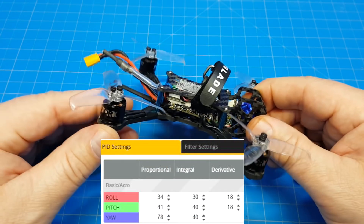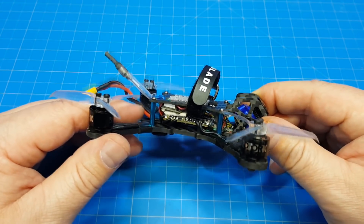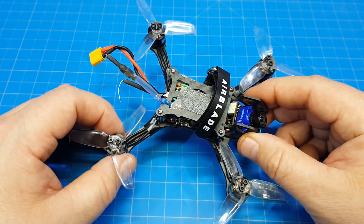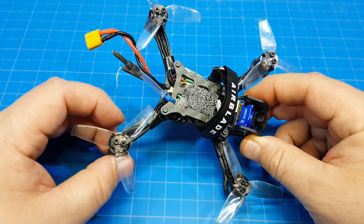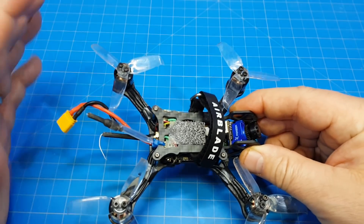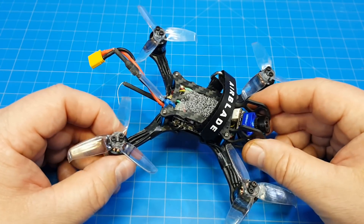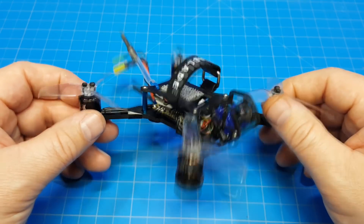Keep in mind, if you're not using these motors in this build or these parts, your results on those PIDs may be different. I did turn PT1 on, and I'm using Betaflight 3.2.2 on this one. I did turn the first two notch filters off, so that helps with decreasing the prop wash, and the motors were coming down cool. That's something I have to be mindful of — through these cooler months, when we get into the warmer months I may have to check those motors again, because ambient temperature may have an impact, and I don't want to start ruining machines because I tuned them too tight for winter.